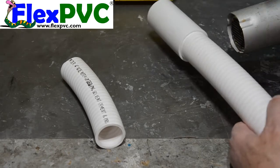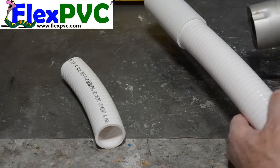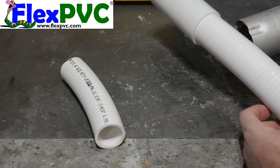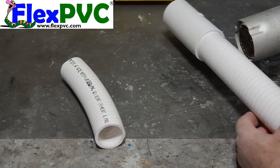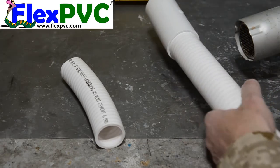If the pipe is attached to the tub, it's very difficult — you just have to get your heat gun in there the best you can. Move the heat gun top, bottom, left, right, whatever you have to do to get in there. But don't leave the heat gun in one spot because it will burn the pipe badly. So you're just going to keep doing this and shove the coupling on a little bit further, a little bit further.